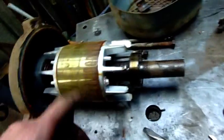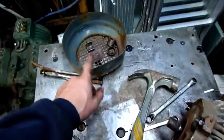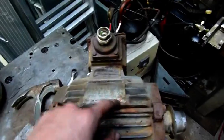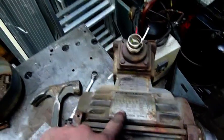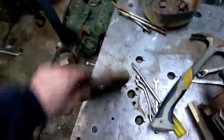The rotors are pretty rusty. That bearing's not bad — it's the front one that's the worst. This cowling fits perfectly on this one; it's the same frame, just a long version. The frame's D90L and that one's D90S — obviously S for short, L for long. And that's the better front-end housing because that other one's pretty badly rusted.